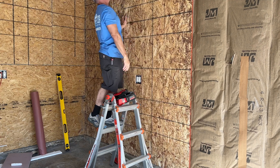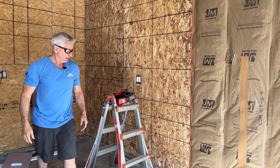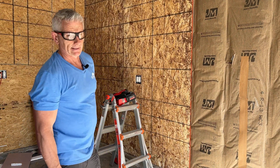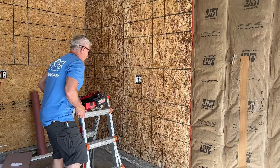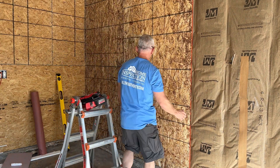It's really tight up here — I've got to cut it again. But I can tell you my cut on the outlet is dead on, that worked out great. I cut a half inch off the top. Can you tell me why I didn't cut that half inch off the bottom? It's because it would have affected the box cutout — I pulled everything from the bottom to find my opening for the box. If I had cut the bottom, it would have thrown everything off and I would have had to cut a new sheet.